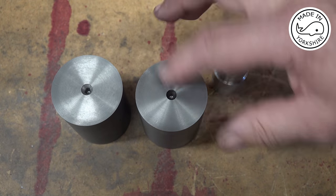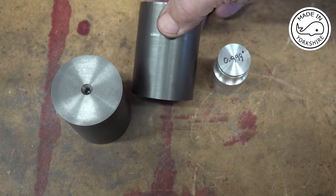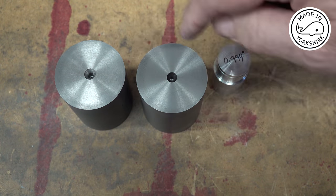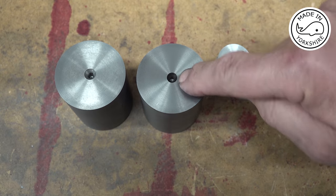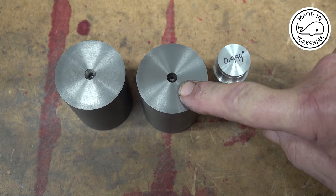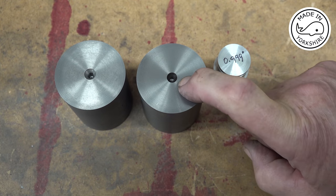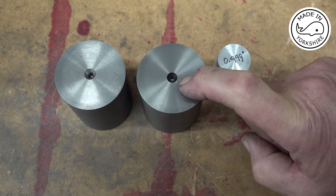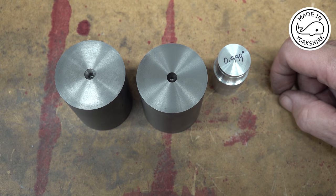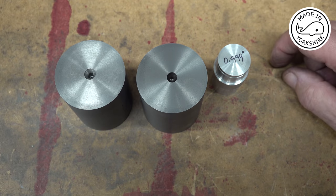Okay so I've got two pieces now, both 2 inches in diameter and the appropriate length. I'm going to bore out the cylinders. The Viton rings I've got are BS020 which give an outside diameter of 1.004 of an inch. So looking at the drawing the piston will need to be about 4 to 5 thou under that.